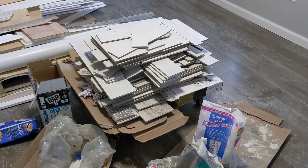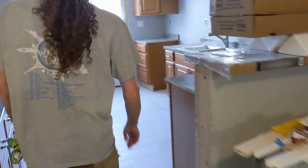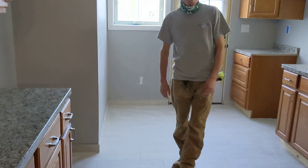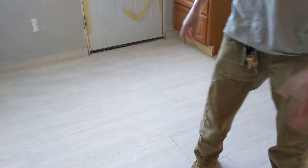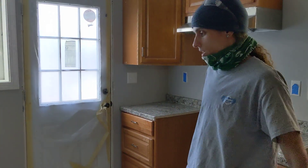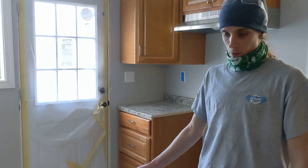These tiles are all extras we can save for backup. Chris and his crew did the tub — they waterproofed it. We got tile in the kitchen, 12 by 24 tile base, so it's all waterproof underneath with the Schluter Ditra-Mat system and the KERDI banding along the seams and along the baseboard to give you waterproofing up to the base of the walls and from the floor.